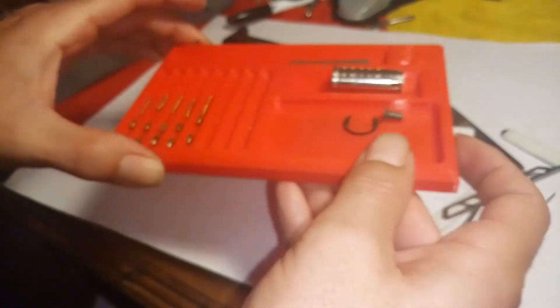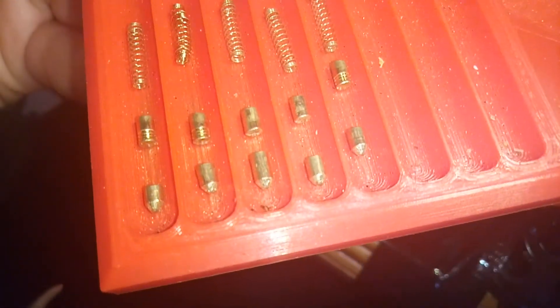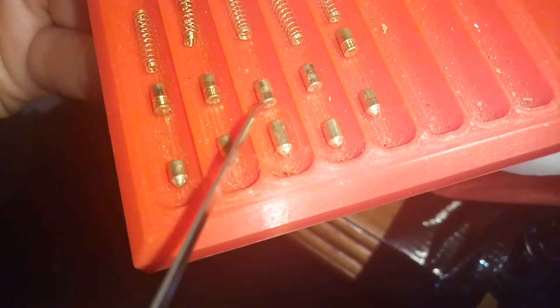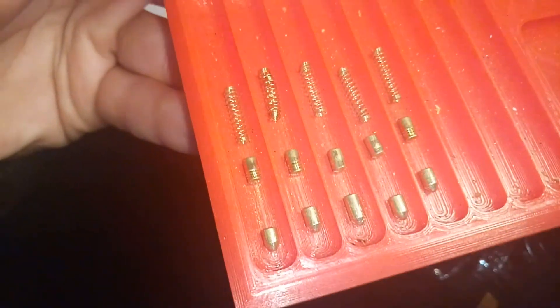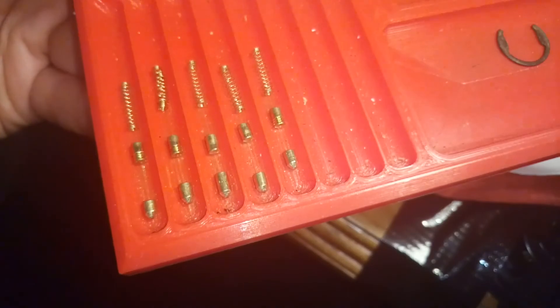Here's the post, and these are the pins. We had standard key pins that might have had their heads sharpened a little bit so they're more pointy. Got one, two, three serrations in the first driver, one, two, three serrations in the second, standard, standard, and then another three serrations with a sharp lip. Double spring in two, and all the rest of them are single little copper springs. That was number one by Jeffrey Post.